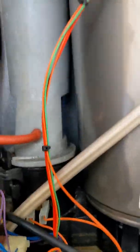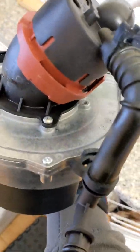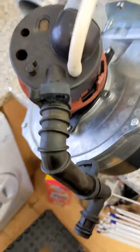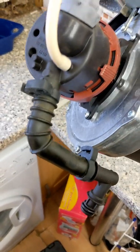Now you can start working on the flow, the return and the flue connections. Also when removing the fan, have a look at the gas pipe tube. Check it for any cracks, nicks, splits, anything like that. This one's in good condition so it doesn't need replacing, but always keep one spare just in case you remove this and find it's split.